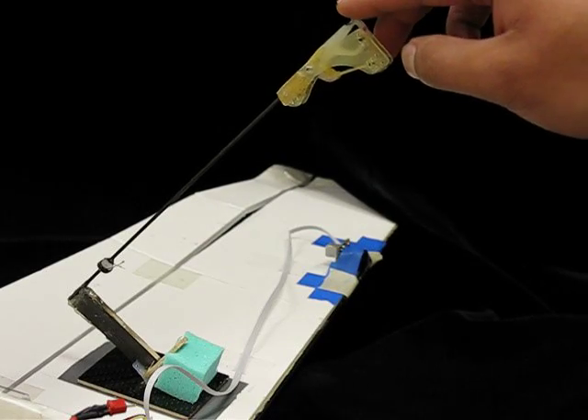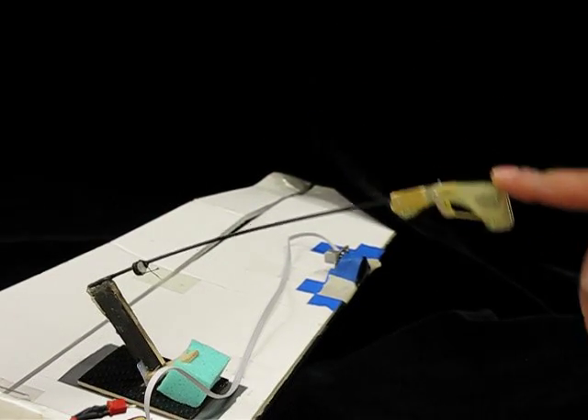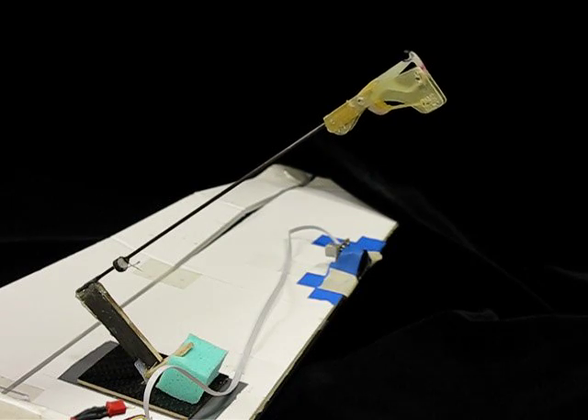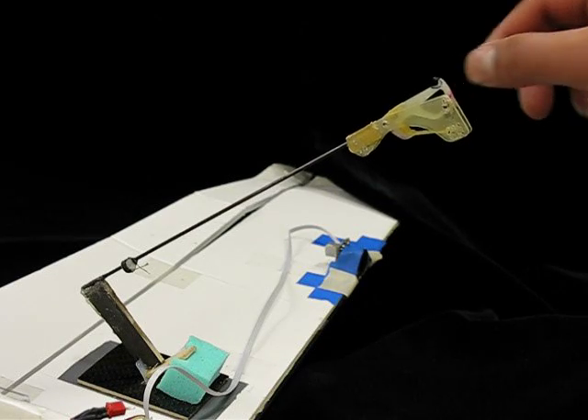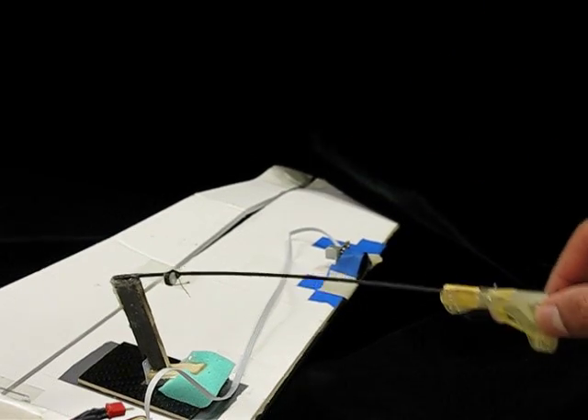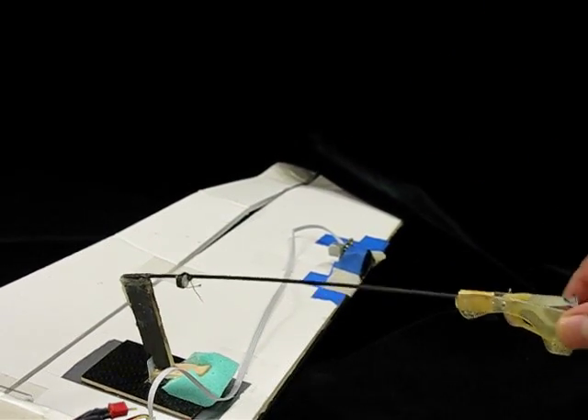A highly nonlinear damped suspension has been added to absorb the impact and direct forces towards the feet, engaging miniature spines at the toes. The suspension consists of a carbon fiber tibia and a carbon and balsa wood femur, along with urethane foam.